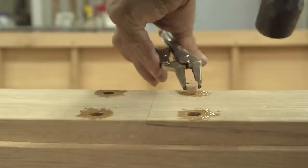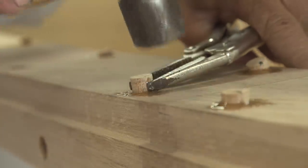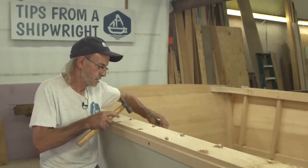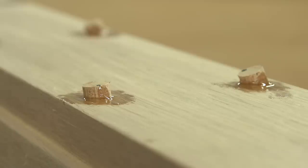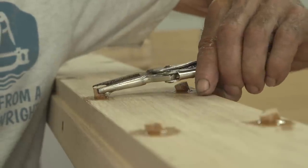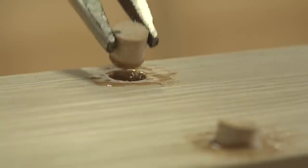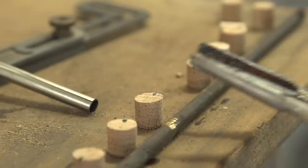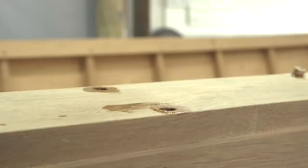It seems like these little steps might be a little much, but you've got quite a few to do, and I think anybody could enjoy doing this at the end of a project. We knock the plugs into place without banging too hard because it squashes them a bit, and there's hydraulic pressure under the plugs — you have to wait a little bit, hammer them in place, then come back and tap them some more. You can feel them move again with just light taps because the hydraulic pressure has been released into the wood. This system with the pliers is just the way to go — doing it by hand is messy and takes too much time.